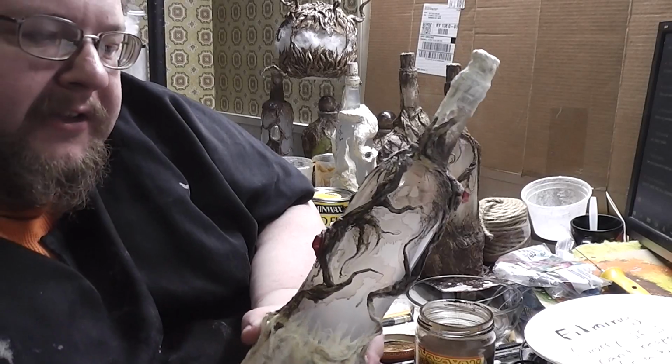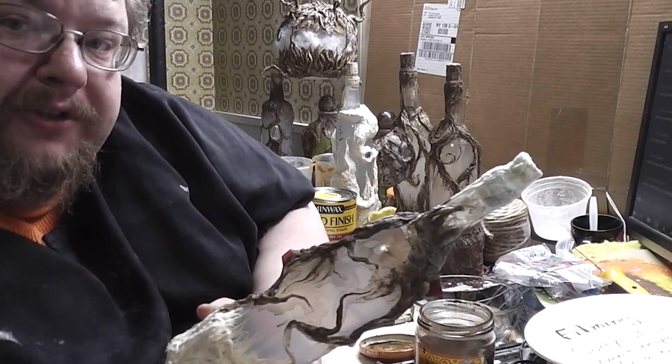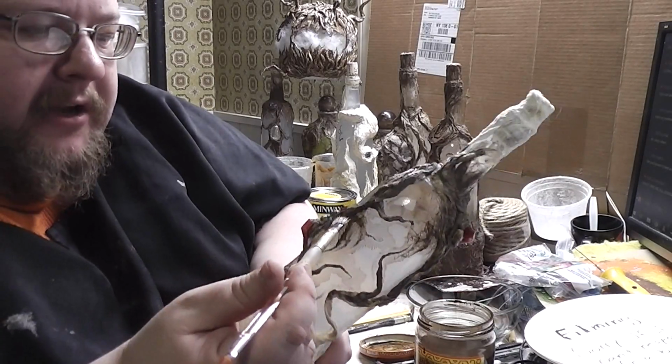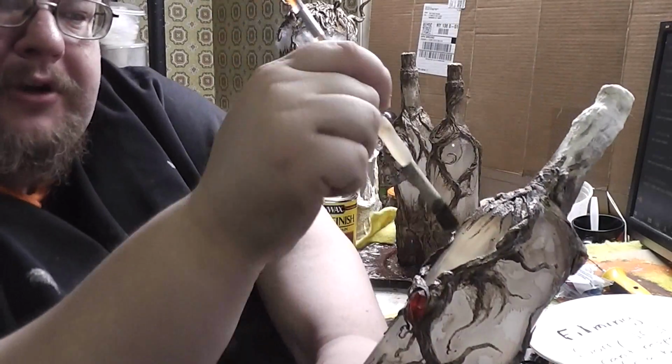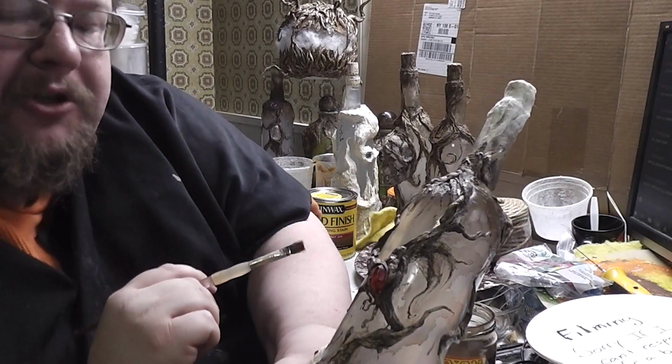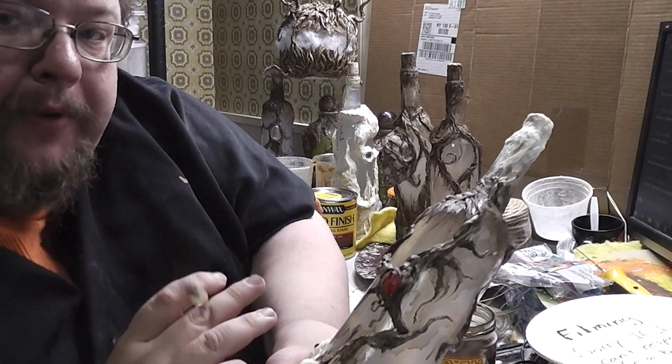Another quick area to consider is, as you're going along with your staining, there's going to be a lot of nooks and crannies. There's going to be spaces here that you've got to bring your brush over around and really tuck in to get to the side. You want to get as much exposure as possible. Be prepared for those.